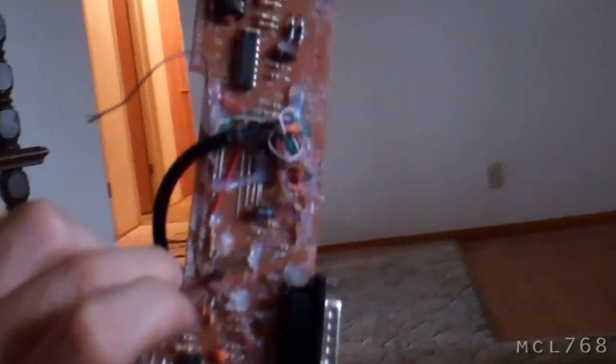Here's the guts to the joystick. I don't need any of this — I ripped all this out. All these wires are from all the buttons on it. But that potentiometer there and that potentiometer there are the ones I'm going to hook up to those connections. I've tested these and the little ones there, and they are the same values, which means it's just a direct replacement. I just take wires from these three contacts and solder them into these, and I just need to figure out which is which. Then it should work — that'd be pretty cool. And this will be easy also.